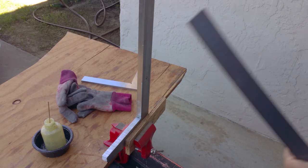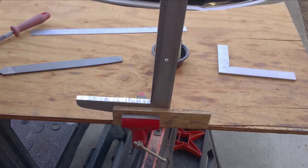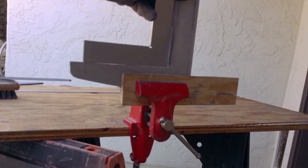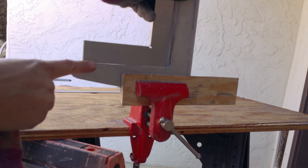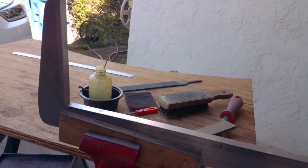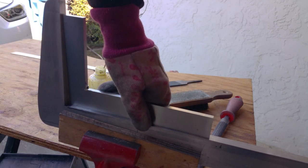After only 10 minutes of work you can see it's not too bad - it's tight here and it's tight here. Now I actually want to put a little pressure on this too. I'm fairly happy with this - there are a couple little scars in it but I'm not worried about that. What I'm going for is just general surface contact. If I put my square in here I'm pretty good - just a little bit of tightness down here which I'm going to take out with this little tiny file in a very local way.